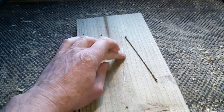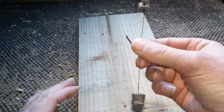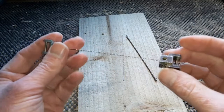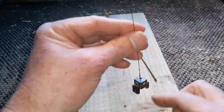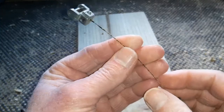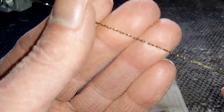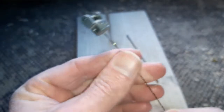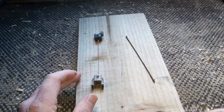If you prefer a straight, flat blade, that one is curved. Personally, you've seen it before, spiral blade for me. I do have to use these adapter clamps on my old Draper saw. Obviously, if you have a modern version saw, they will just clamp in top and bottom. They're called spiral because the teeth are spiraled the full length of the blade. So basically, you could cut in any direction with that one. Any direction, up, down, left or right.